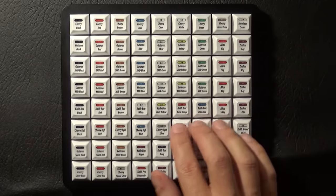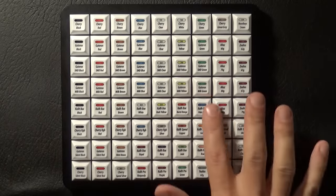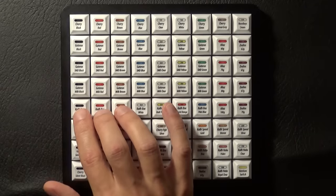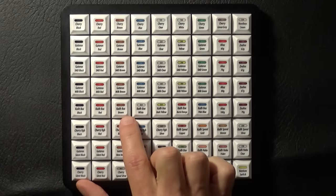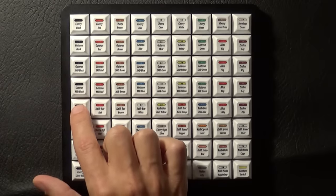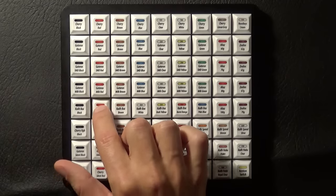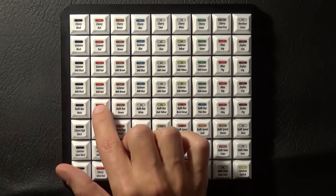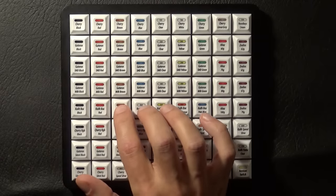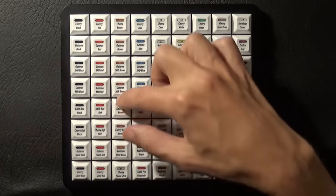So let's move on to Kailh now. This part is mostly Kailh switches. So first Kailh Box: black, red, brown and white. Sixty grams. 50 grams rather than 45 grams actually for the Kailh red. And 50 grams also for the brown rather than 45 for the other brands.